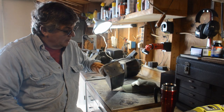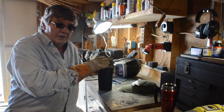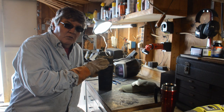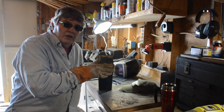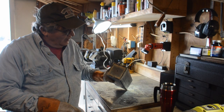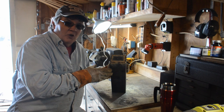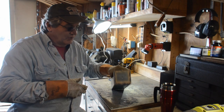I've got it tacked up and I'm MIG welding it — got a little splatter on it. I'm going to finish welding it up, then grind off all the excess weld and make it look pretty. This doesn't really have to be a super strong weld; it's just something to hold the chain or grease gun from falling through. I've got it welded around all the corners, and now I'm using a flap wheel on my right-angle grinder to smooth it all out and make sure all the burrs are off. Now I've got it ground smooth.